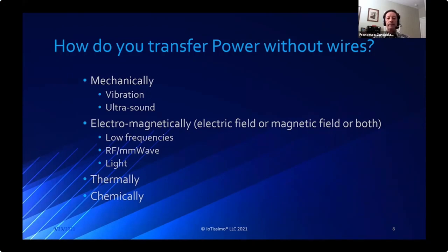When we talk about the electromagnetic field, you can transfer energy both from the electric field and the magnetic field. Most applications use the magnetic field because they can be done at fairly low voltage. If you try to transfer energy with the electric field, as soon as the distance becomes significant - because it's a capacitive type of transfer - you need a very high voltage. Think about cardiac defibrillators in the emergency room: that's a high voltage electric field transfer, not magnetic field.